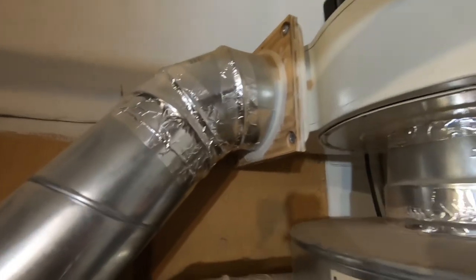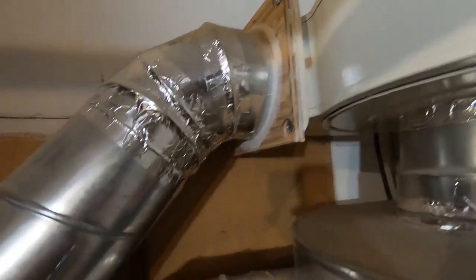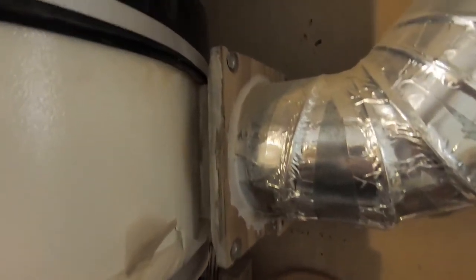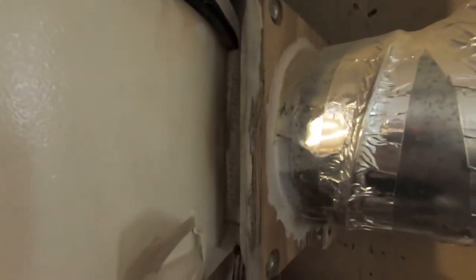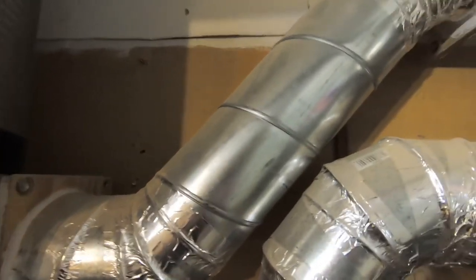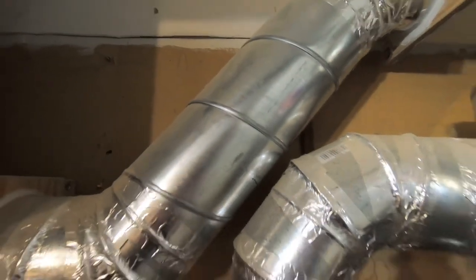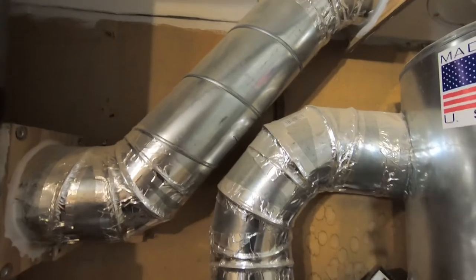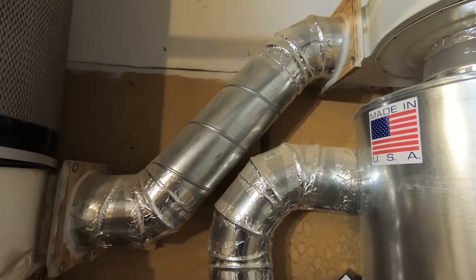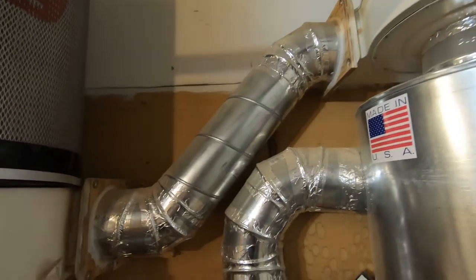This is the only real piece I had to manufacture. When you pull it apart I'll show you the other side — you basically just have to make your own fittings, and I made them out of plywood. I cut six-inch holes out of them, bolted it to the original dust collector assembly, used some caulking, and it worked just fine. For all my dust collection ductwork I use six-inch spiral tubing. I have a big wholesaler in Nevada called Western Nevada Supply — a building and construction supply store — where you can get 10-foot sticks of this stuff for around $15 or $16. It's really inexpensive.